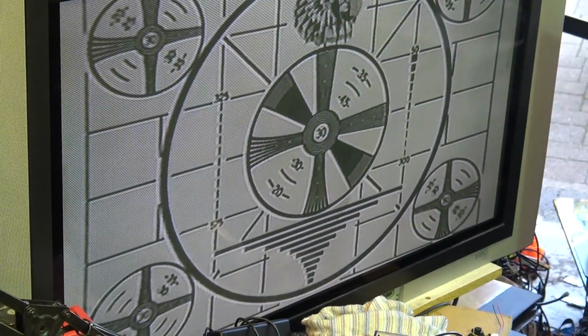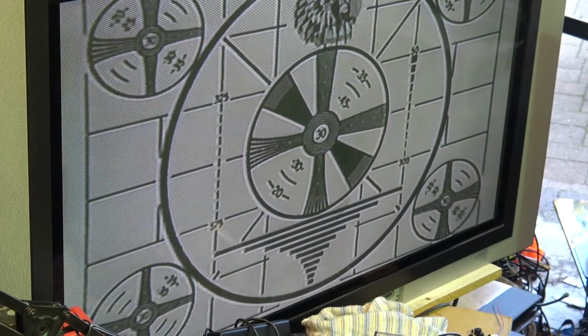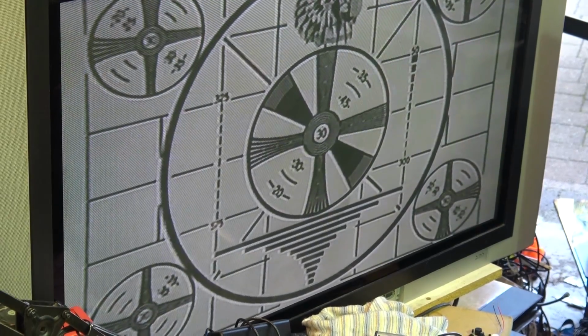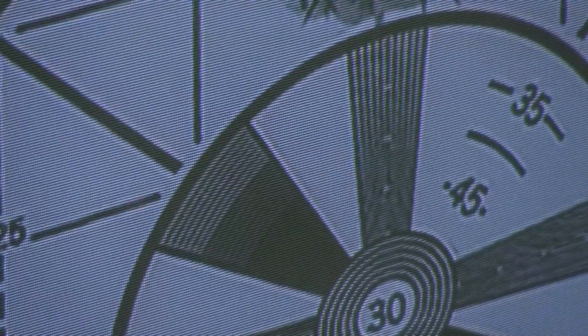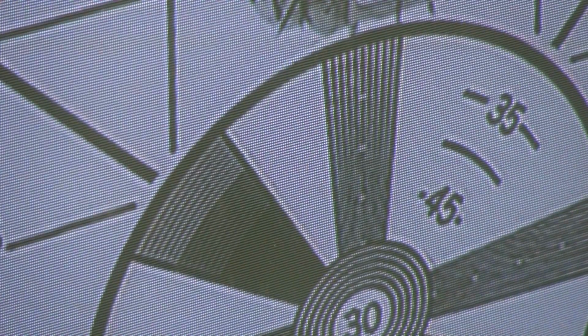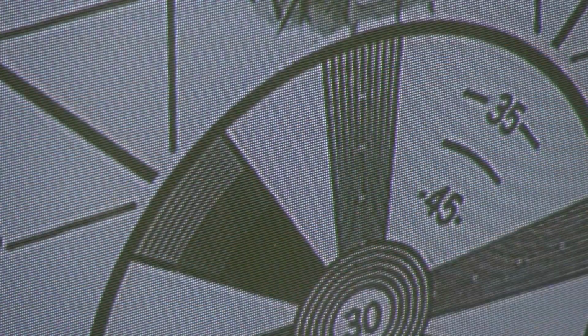I'm going to go get my other camera, my much higher resolution. It's an HD camera, but I can take the S-Video out and we'll plug that in, and we'll do the same test off of my 3-chip professional camera. Okay, on this camera you can see that I can clearly get well up. The display here is showing almost 500 lines. This is the HD camera, but we're limited by NTSC's resolution, but we're going well beyond 400 lines of resolution here, somewhere around there. Okay, that's what we're looking at.